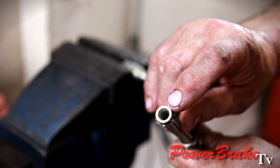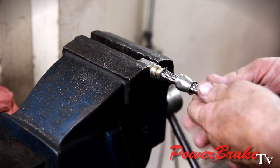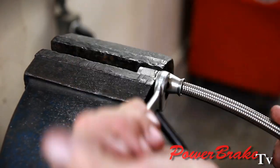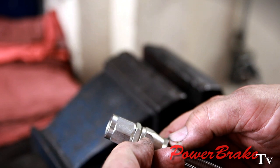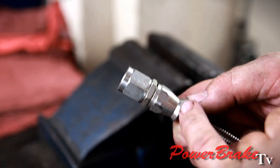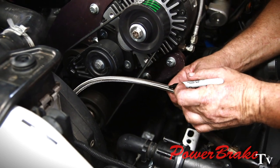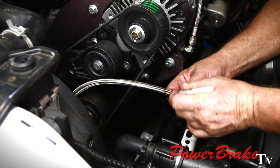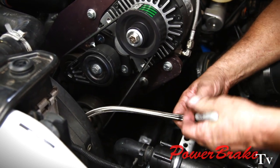We've got the olive pushed over the Teflon lining of the tubing — we'll push it over this end. There's our line completely assembled. We'll leave about a fingernail thickness between the two nuts. If we over-tighten it, it'll crush that olive sleeve and then it'll leak. We've taken our five-foot line, routed it where we want, and we're marking it with a felt pen for the cutoff point. We'll mark it, cut it, and put the end on.